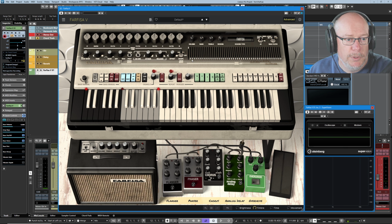Let's introduce some new harmonics. Oh, I accidentally flipped over to the fourth harmonic and you saw it pop up on the spectrum analyzer. And as you can see, it's doing a very good representation of exactly the job it's being asked to do. It's generating harmonics at exactly these frequencies, adding them all together. That's how an additive synthesizer works.